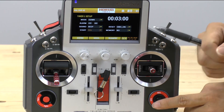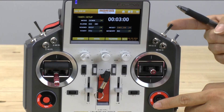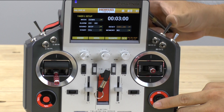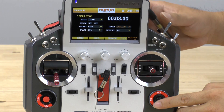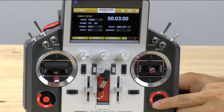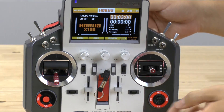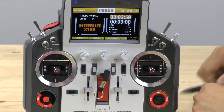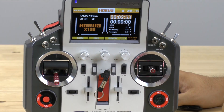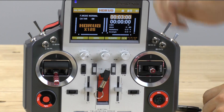Over here on this side, it'll tell you which switch to put it on. I have it on this switch up here, which is the momentary switch so that I can reset it. It's on a spring so it will reset itself — I find that's the easiest switch. This is also commonly used as the trainer switch. Then you can choose whether to log the times, which I put at no. Now if we go back to the normal screen and move up on the throttle, the timing will start moving. When you bring it all the way down again, the time will stop, and hitting the momentary switch will reset the time.